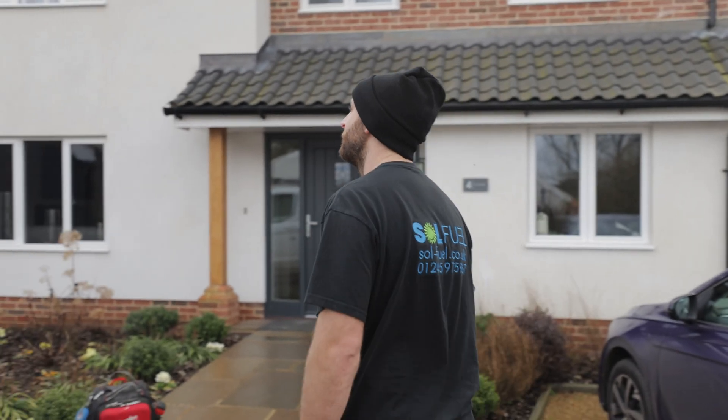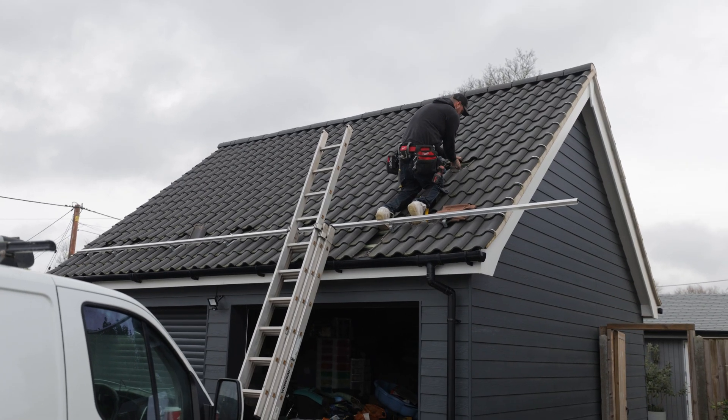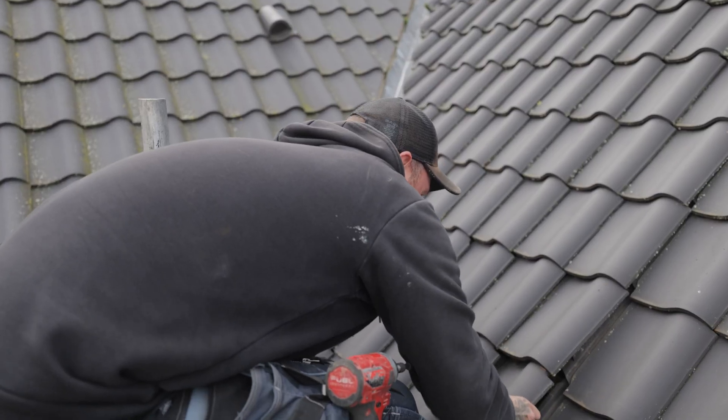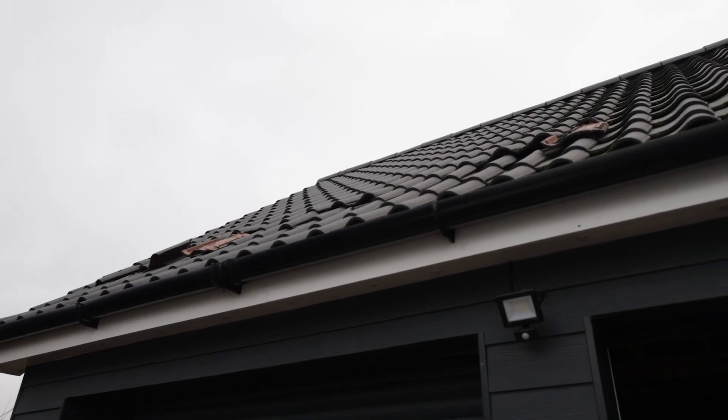Never an easy job — nice tiles usually give you a little wiggle and they sort of pop out. But on this roof the builders or roofers have used massive nails and hammered them right in, so the tiles are super tight with no wiggle room. That means they're not coming out very easily, so there's probably going to be some broken tiles which we'll obviously have to replace.